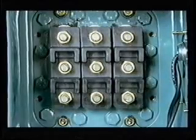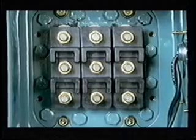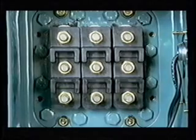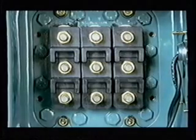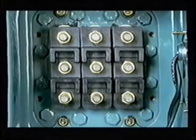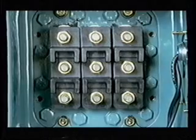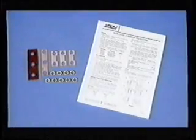The most recent nine post terminal plate configuration used on multi voltage models is shown above. The low voltage 208/230 volt winding can be wired for both across the line and part winding starting. However, the 460 volt winding can only be wired for across the line starting. Discrete 460 volt models must be used for part winding start applications. The O6E multi voltage replacement compressor must be field wired. The terminal plate jumper bar kit is used to connect the motor terminals. Carefully follow the instructions shipped with the replacement compressor and consult the wiring diagram located inside the terminal box.